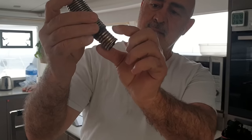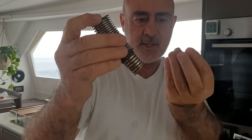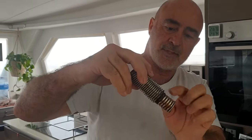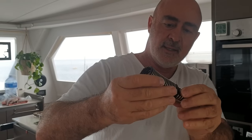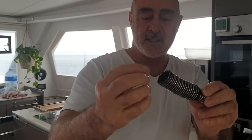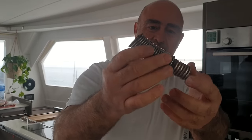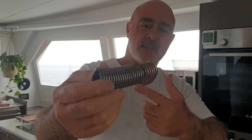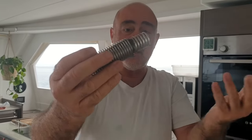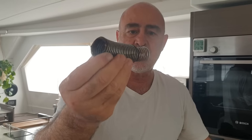What Action Yachting has done is take a smaller internal piece and push it into the exhaust pipe - so the exhaust fitting has its own stainless steel pipe, and they've pushed a small piece in and used more material on the other side as a joiner. Every time we touched that join it was breaking, and rusted water would come up. This is basically a brand new installation and it's already rusted after maybe three or four months - we've only been at sea for a month. This entire diesel heater exhaust installation needs to be redone.